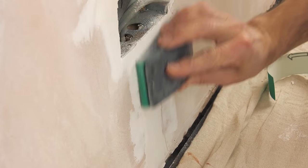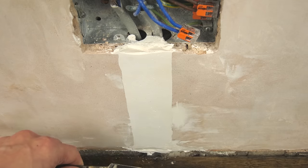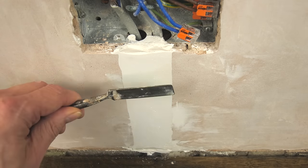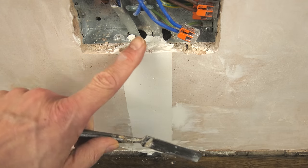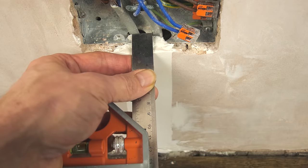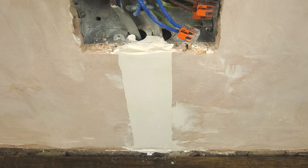A final quick sand of the touched-up areas and the job is complete. Going back to the point about the enhanced performance of powder fillers over ready mix — you'll have noticed when I applied this there was minimal slumpage, which is pretty remarkable considering we've got a fill depth of around 25 millimetres. And the fill is set to a rock-hard finish. Just a couple of the reasons why I like working with this stuff.